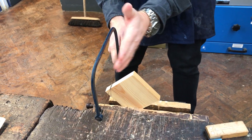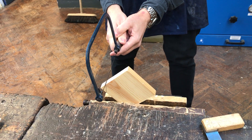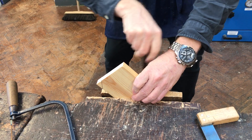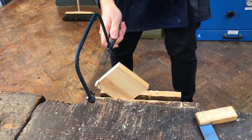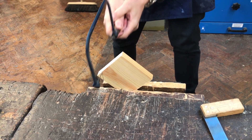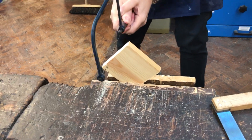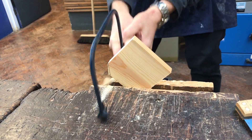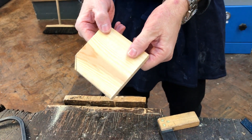Nice and gently — keep the blade nice and straight. Don't let it go off to the side. Feet either side apart and two hands on the handle. Just gently. I'm looking up and I can see my line's not quite straight, so I'm trying to get it straight. Watch what you're doing to make sure it's going straight. You can see we haven't cut quite on the line, but just enough to sand down on the sander, which I'll show you how to do next.